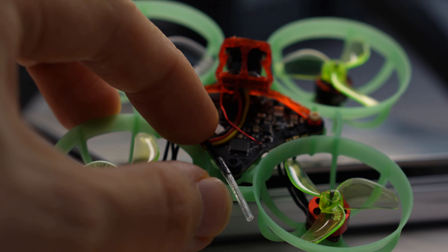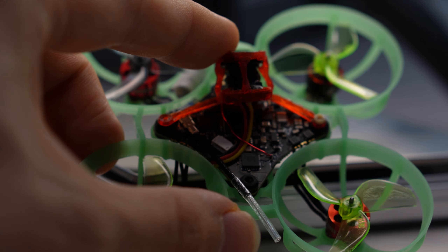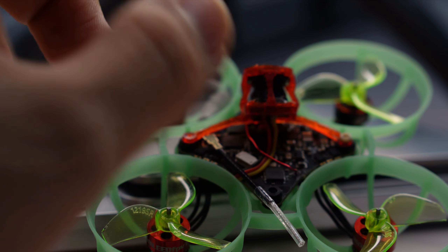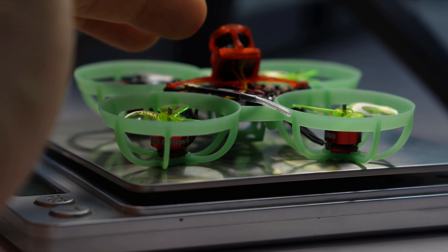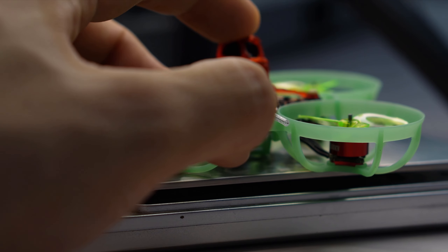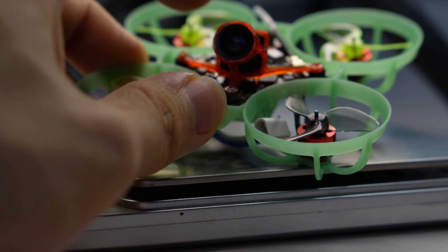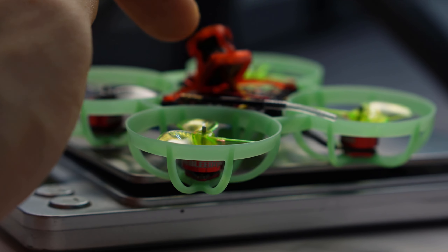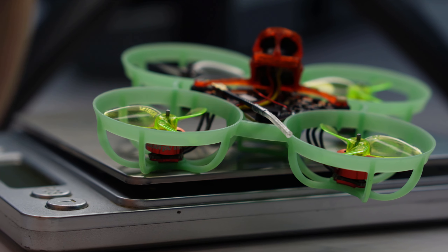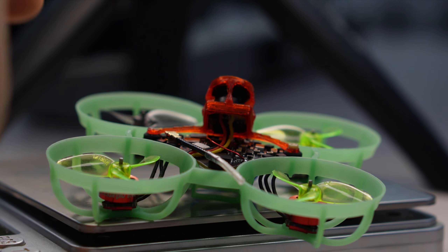One more consideration is because there's a camera plug right at the top over here. And if you mount the board with the regular Beta FPV canopy, it kind of sits the camera much higher, meaning there's no contact between the camera mount and the board. However, I'm using this little stinker mount which is very flush and close to the board itself. There is a possibility that when you mount it the correct front way, it's going to cause the camera to be lopsided. That's another reason why I chose to rotate my board by 180 degrees.